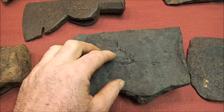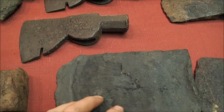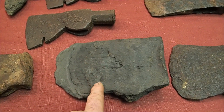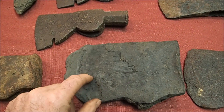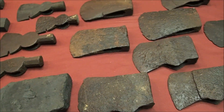You can tell this one looks really soft — it's much darker than some of the other axe heads, and it just looks softer. That's called graphiting, and that's when the iron actually leaches out into the soil or the water and makes it much softer, kind of turning into graphite. The same thing happens with artillery shells.